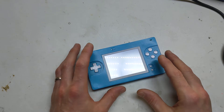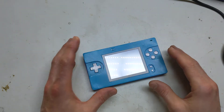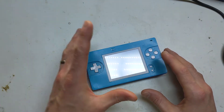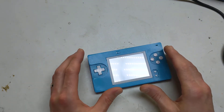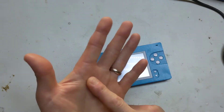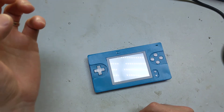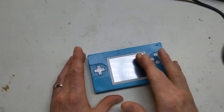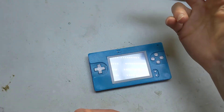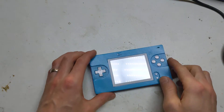It's a byproduct of the DS Lite video out mod. You do the firmware flash but you don't actually do any of the other mod to it other than add the button. The way I see it: with the screen-switching video out mod, you can press three buttons — one to swap the screens, one for picture-in-picture, and one that does a contrast overlay with both screens on top of each other. So we're using one switch to switch the screens to the video out mode, but with no other screen connected.